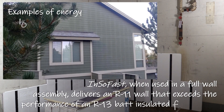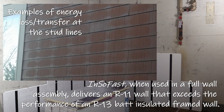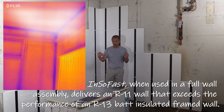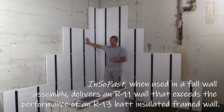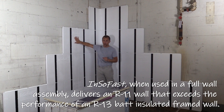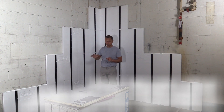If you compare that to a wood framing wall with R 13 insulation, that would give you an R 10.18 because of the thermal penalties from the studs and the thermal transfer. But with our system, there is no thermal transfer and the studs don't transfer energy. So you get a true R 11 wall assembly, which is just a tad bit better than the R 13 framing wall.